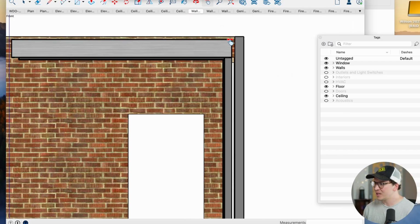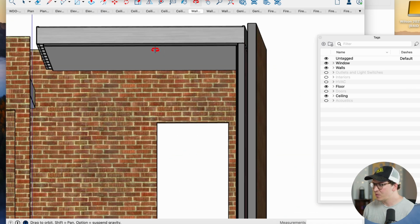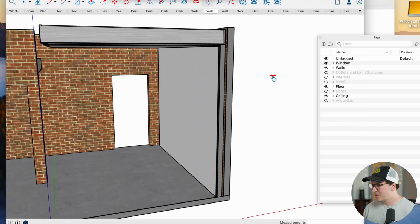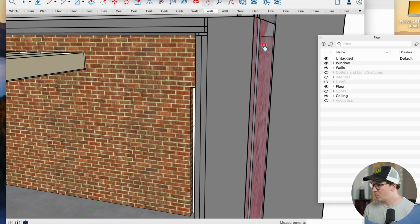And we've got a fully decoupled ceiling here, which is actually kind of rare that I do this, built off our inside wall. And the existing ceiling is going to be above. Again, it's going to be a concrete ceiling. And so we've got a new ceiling below that is going to provide our isolation there. So, pretty cool little design from the wall perspective. Let's take another look here. Here's another example of our wall, and you can see the 2 layers, and then we've got insulation on the back side here in between our wall system.